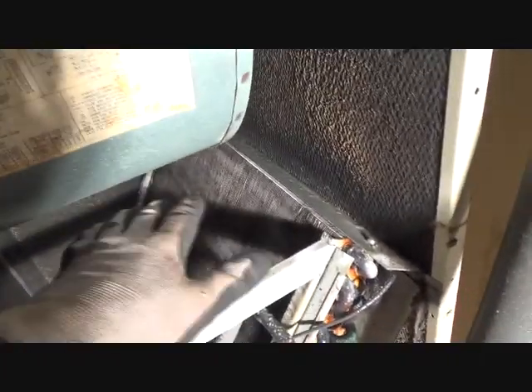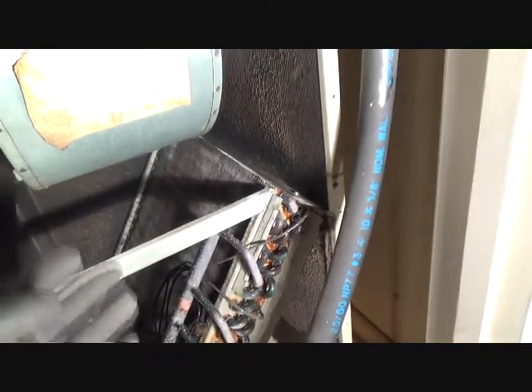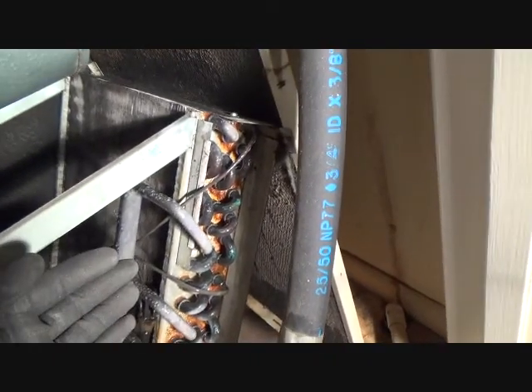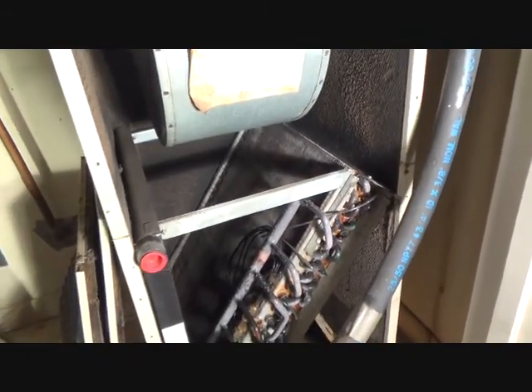We have a corporate decision. I think it's not dripping as much, but it's still dripping from the top. Remember how white this was? That's because it was cold. We just shut the air conditioner off and it immediately went back to the color you see now. With the covers being off, it's letting some of this air come out this way and it wasn't cooling the air down hardly at all. We reached up to a register, even got on a chair, and the air didn't feel icy cold — I think that's because we have this panel off.